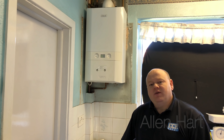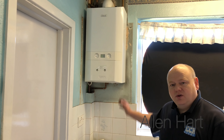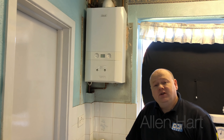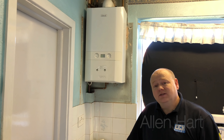My name is Alan Hart and today we're doing a day in the life of a plumber slash gas engineer. Today we're doing a power flush on an open vent system and we've been called out to an Ideal Logic. The customer wanted to put this onto a service contract and the energy supplier has said it needs flushing, so that's what we're here to do. I'm going to do an overview of what we're doing, take the pump out, and show you how I flush a heating system.